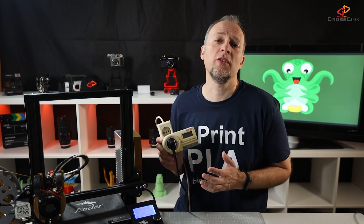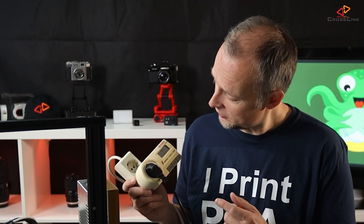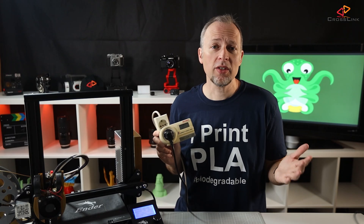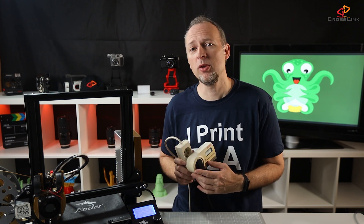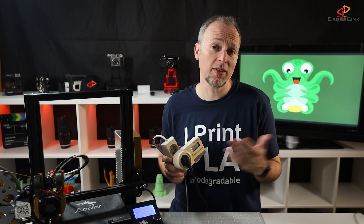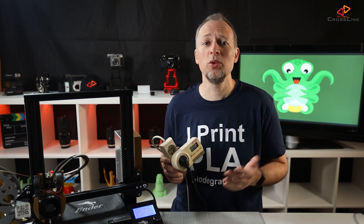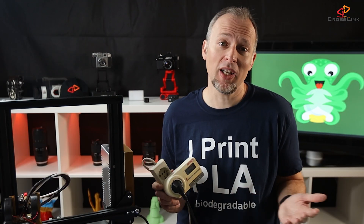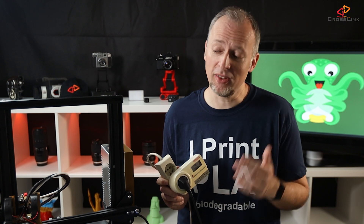Just to give you a little more reason to fix that — I'm measuring the power consumption of this Ender 3 when it's just doing nothing, and it's actually using 8 watts. That doesn't sound much, but if you let this happen with multiple printers like I sometimes do, that sums up to a few bucks every month just from being lazy. So let's not be lazy, let's do something responsible and get this working.